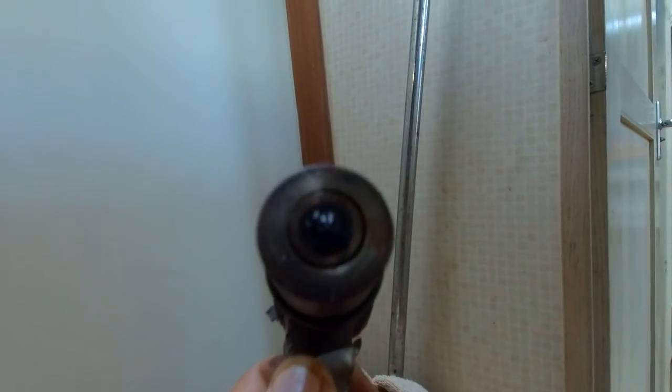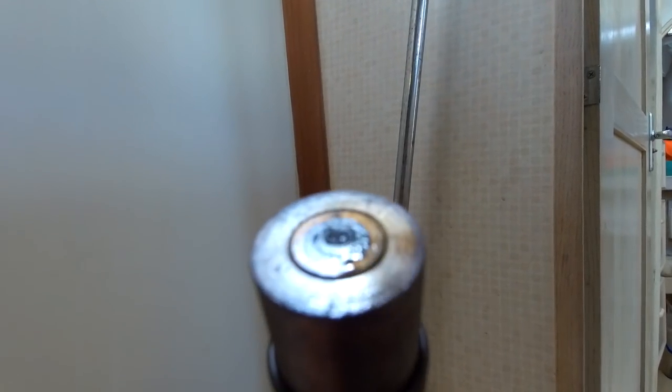Back in the engine room — I've had a problem with the port-side engine for a while: on start-up it blows a lot of white and black smoke. That's a sign we need to clean the injectors. If we were in Australia I'd send them to a shop to be bench tested and crack tested, but we're not, so I'm doing it myself. This is the number one injector — the spray pattern is supposed to be even and perfect so the diesel atomizes and burns properly. Right now there's just too much carbon build-up, so I'll pull them apart and clean the nozzle with a toothpick or swab to get all that carbon off.